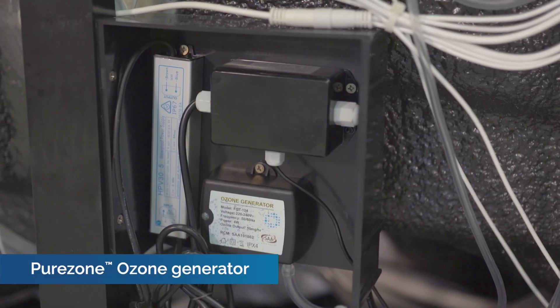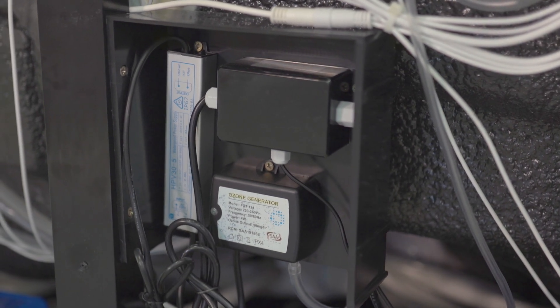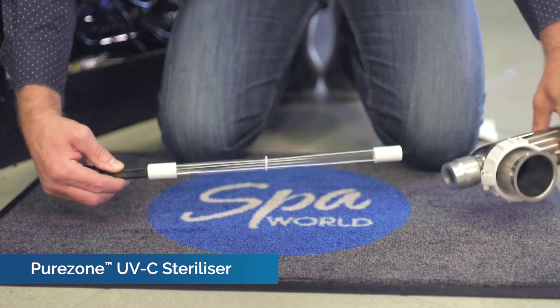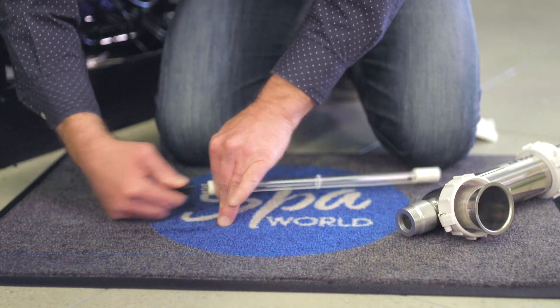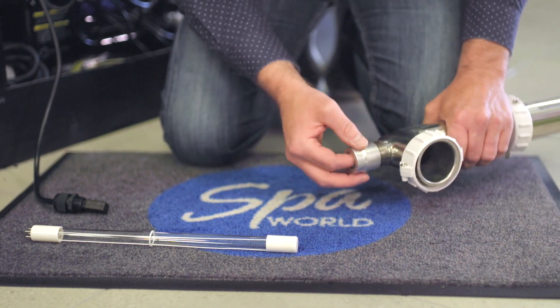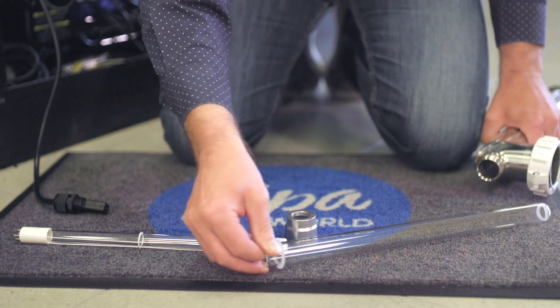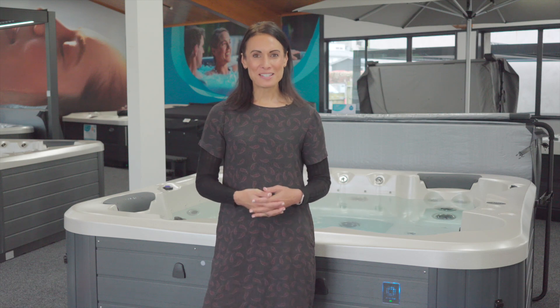UV light penetrates the cell walls of nasty microorganisms so they can't reproduce. Ozone treatment also leaves no residual odours and helps to remove contaminants that can cause cloudy water. These systems consist of a UV lamp enclosed in a clear quartz sleeve that is mounted inside a stainless steel chamber. Water from the spa pool or swim spa is pumped through the chamber, passing by the UV lamp where the UV light is emitted, before returning to the spa. The UV treatment process occurs as the water passes through the chamber, with the exposure time being dependent on the flow rate of the water and the intensity of the UV radiation.